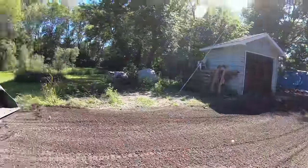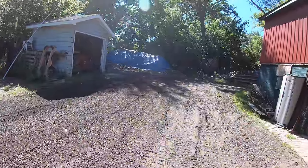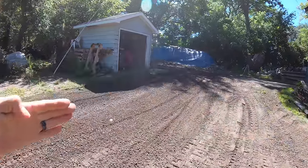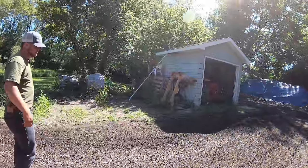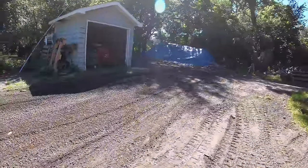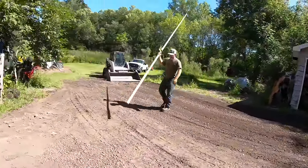I see a couple of holes I was just about to fill in. Okay. I see one right there — a little one right there. So let's see if we've got pitch, because we want pitch running all the way down past the building and then down past this building here. So grab your rod. Have you checked your pitch? I just checked my benchmark. Yeah. Alright, let's see how you're doing. We'll go back to our benchmark just in case during the course of the day the laser got bumped somehow. A lot of times it'll happen if somebody stands between the laser and the receiver.